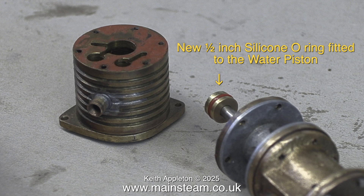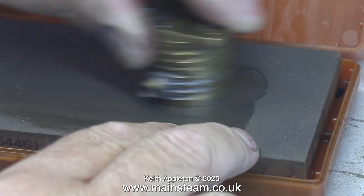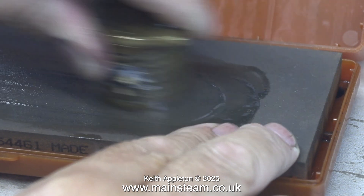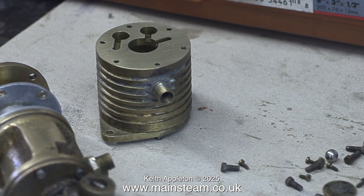There is however a problem visible in this clip. When the water piston was separated from the main mechanism, part of the gasket fragmented and I don't really want to make a new gasket. So this is how I got around the problem: first I smeared the gasket on the main mechanism with some Loctite 542, which effectively repaired the gasket — it's a hydraulic sealant and once it's in place it will be fine. Then I scraped off the gasket material from the water cylinder, and used my wet stone to make sure the water cylinder was perfectly flat. This took quite a while but in the end it was a perfect finish and should give a good seal. The small amount of Loctite 542 smeared on the original gasket should ensure a perfect seal.